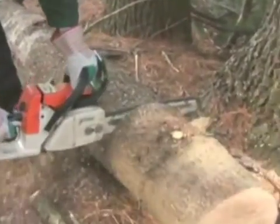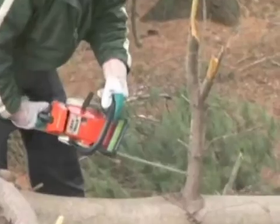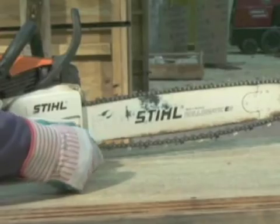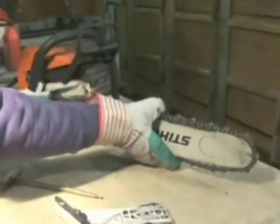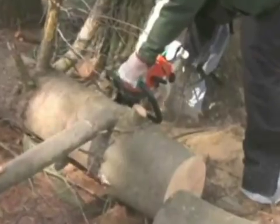A dull or loose blade can also cause you to force the saw into the cut, which is a very unsafe practice. In order for the saw to function properly and safely, it's important that the chain be kept at the proper tension. Loose chains mean trouble. When the chain is too loose, it can cause the bar to wear excessively. If that happens, the saw won't operate effectively. Worse than that, a loose chain can fly off the bar, creating a very dangerous situation.